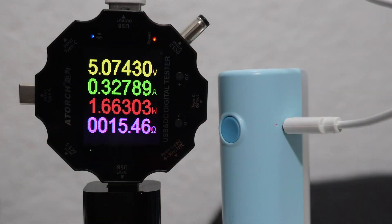They do give you a Type-C cable. You can charge this from your cell phone charger, your laptop charger, or plug it into a computer. On the packaging they claim 5 volts, 1 amp — so you'd think this is going to charge at 5 watts — but actually it charges at around 1.6 watts, which is really a little bit slow. That's why I say this is not quite perfect. The packaging says four to five hours to charge, and I can believe that because it's 1.6 watts.